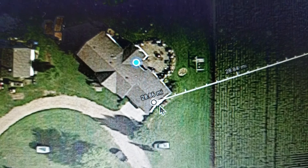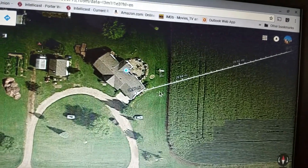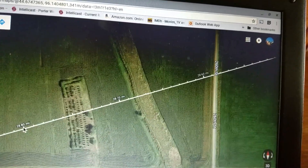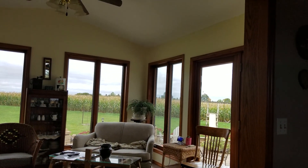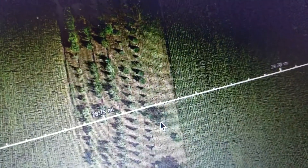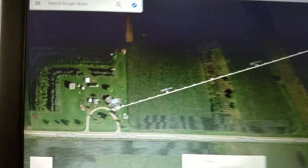Now I can see a line that shows where my antenna should be pointed. It's a little difficult to see, but it gives you an idea. It looks like I should point my antenna off the roof this particular way. To really help fine-tune it, I can look at my neighbor's hill and find the particular tree that is right there, then aim to that side of that tree — that gives me the direction I need to aim my antenna.